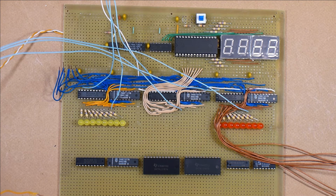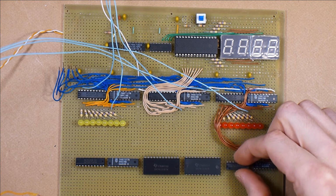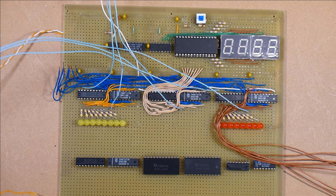And exactly for the overflow, the 74LS181 doesn't come with an overflow pin. It doesn't signal if the arithmetic it's calculating has overflown its capacity. So we're gonna build one overflow detector with one 74LS151, which is a multiplexer. We'll just use its combinational logic. It has inside many ANDs followed by a large OR gate, and we'll connect that in a way that will enable us to detect an overflow. I will also explain that more on the schematic.